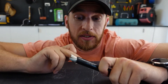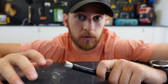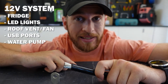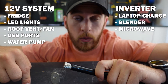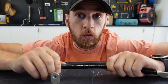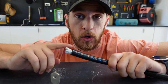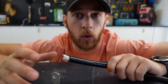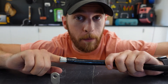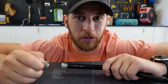I wanted to discuss why this gauge wire is so thick. I had to calculate my entire electrical system's power at max output at one time — that includes all my 12-volt appliances from my DC power and also my 240-volt from my AC power, which is my inverter. This is a massive safety measure because if you don't have the right size gauge cable, you can risk burning out your cable and creating an electrical fire. Definitely have a look at other YouTube videos on cable sizing — they are extremely helpful. Just make sure that you look at all your appliances at once at max output, and that will determine the size you need to parallel your batteries.